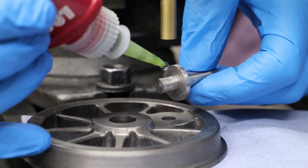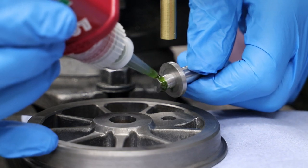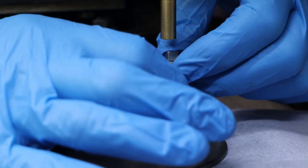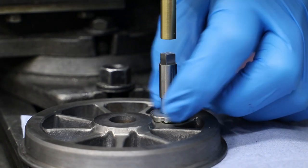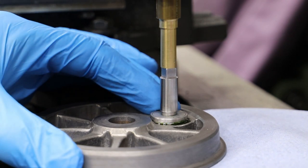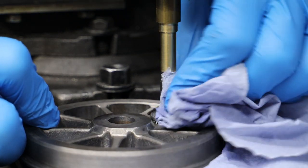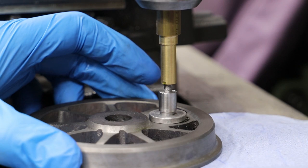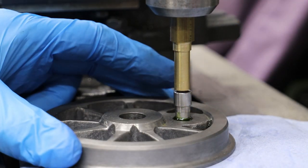Converting Don's designs from Imperial to Metric for the crank pins was a bit of a tough exercise. There's quite a lot of complicated detail and there's not a lot of space to play with between the coupling rods and the driving rods, but I'm fairly confident I've got it all right. So after double — in fact triple — checking the dimensions of the pins I've turned, it's time to get on and Loctite them in place. The fit of the pins into the holes reamed into the wheels varies from a light push fit to some that are a little bit more snug, so to fit them I use the milling machine as a press and after applying the Loctite to the pins I press them home, then use some acetone-soaked tissue paper to clean up the excess. When I apply the Loctite I put it on the bottom of the pins with the intent that as the pin is pushed home the Loctite fills the recess that I've turned in each one of them.